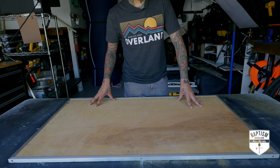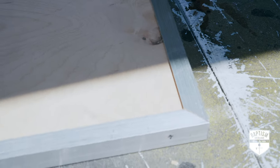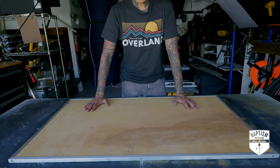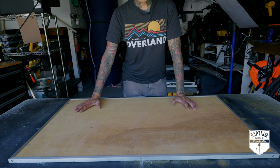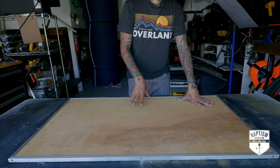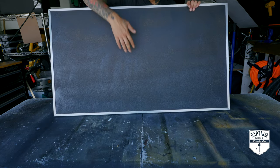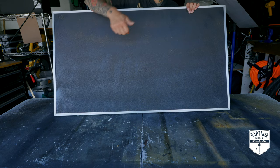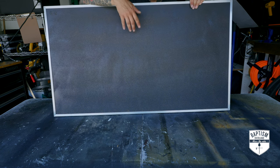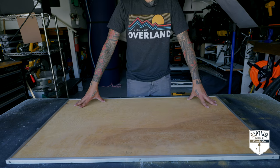So the table is done. Looks really, really good. I'm actually most proud of the corners — after some cutting, grinding, sanding, and tweaking, I was finally able to get the corners to match up really nicely. As far as finish, I decided to just keep the polyurethane clear coat look. I like the feel of bare wood. I was going to use the Raptor truck bed coating, but when I tried it on the other side, the paint left all this lint on it. I don't know if it's because I sprayed it onto plywood, but it didn't come out as nice as I thought. So I'm keeping the Raptor for the bottom and the polyurethane look on top.